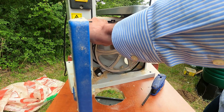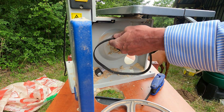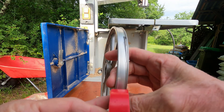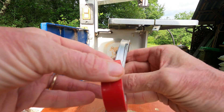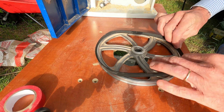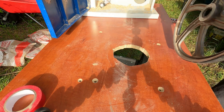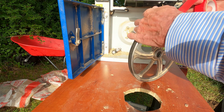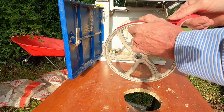Firstly I removed the wheel, the blade, and the old tyre. The options were to wind the tape just around the bare wheel, or to replace the old tyre and then secure it on with the tape. I decided to use the latter strategy — replacing the existing tyre using the last of the elasticity it had, and then winding the electric tape around the wheel about six or seven times.